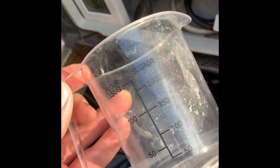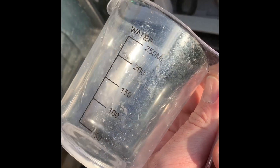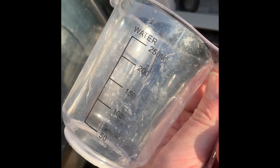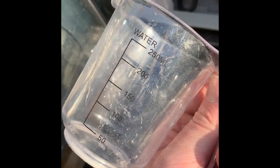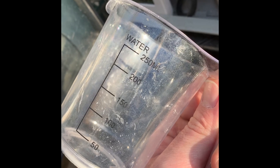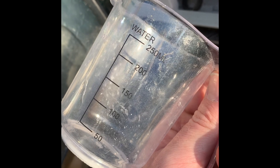The easiest way to check that this is reading correctly is simply to use a jug - measure millilitres and set your stopwatch. What I did for this one was run it for about 30 seconds and got about 150ml. That relates over a minute to about 0.3 litres, which is exactly what the meter is reading, so I'm really comfortable that it's working accurately.